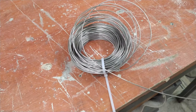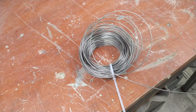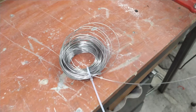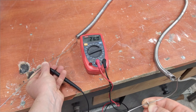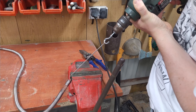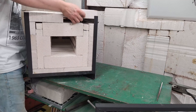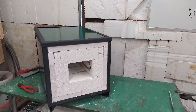So now the heating element. Of course, it is going to be a spiral made of Kanthal wire. Not everybody explains how to calculate the spiral heater parameters, or why it is a spiral and not something else, and why the spiral is twisted at its ends even if the wire itself is very thick. I will try to explain all that, because this spiral is the most important element in the oven. The most obvious thing — the shape — why spiral? It is easy to make and easy to attach to the walls. Second thing: the twisted wire at the end of the heater. The twisting increases the diameter of the input and output part of the heater, therefore making the ends heat up less than the rest. Still, even with that, it is good to use a ceramic connector between the heater and the electric wire.